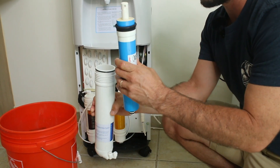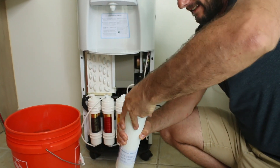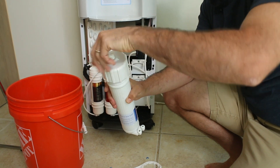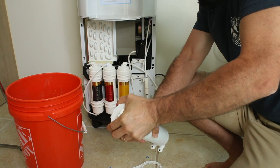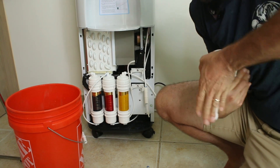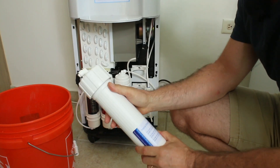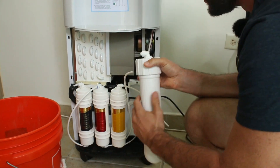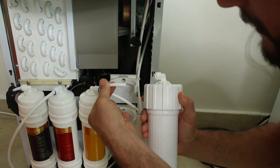I got this cleaned up, rinsed it to get that preservative off. Push it down in there. Thread this on, throw the tool on and throw it in a headlock. Now it's on there. The filter has been replaced, but as the manufacturer says, you want to flush the lines like with any filter. So I'm going to connect two of the three lines so that we have one open to flush this out.